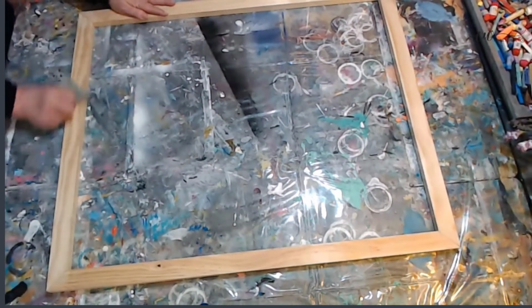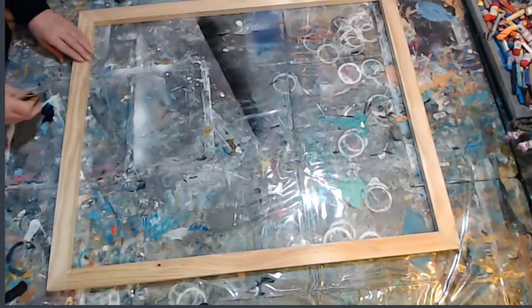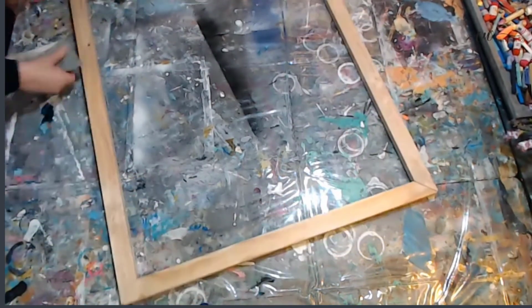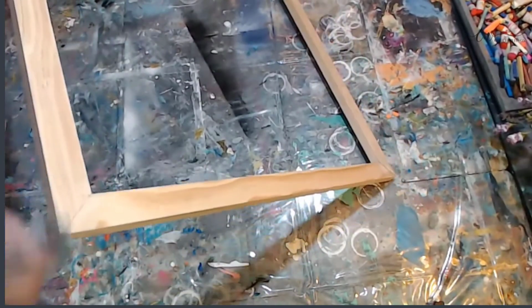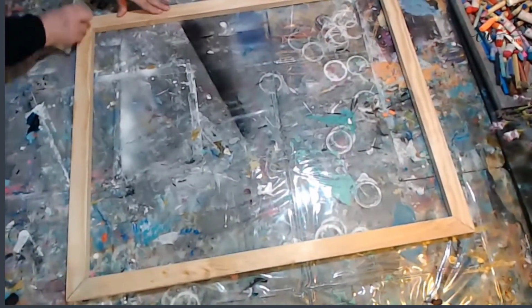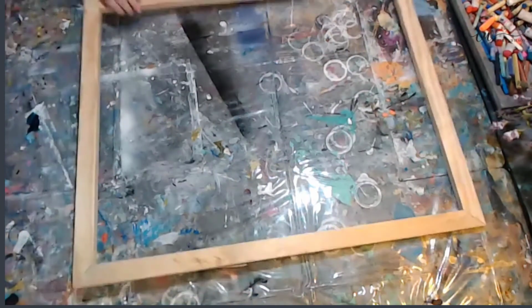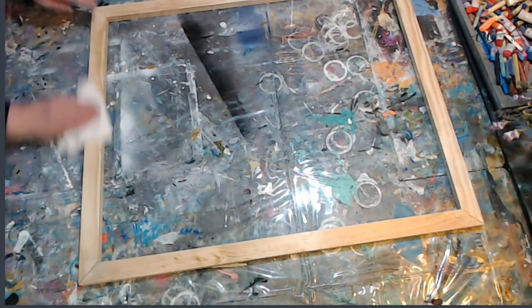So I turned the sound down because I think the scraping of sandpaper is kind of like the equivalent to nails on a chalkboard. But I'm sanding down the pine wood, and that's what it says to do before you add the stain. And this part goes really well. I'm sanding it down. Of course, the corners, I can still see some of the dark. And what happens, I learned, is when you put the stain on, that's just going to darken everything.